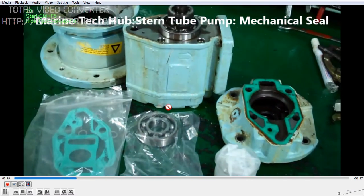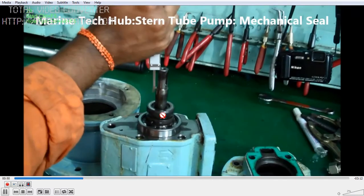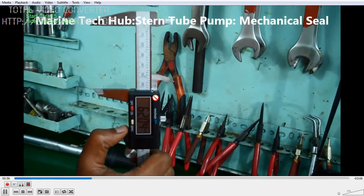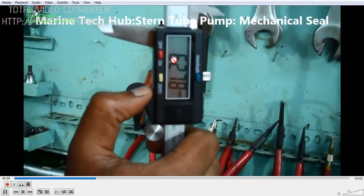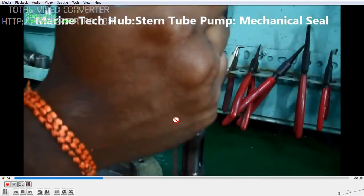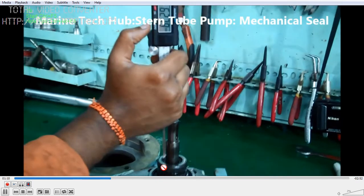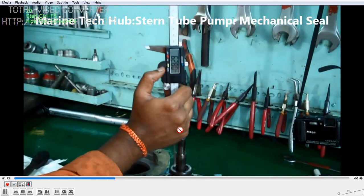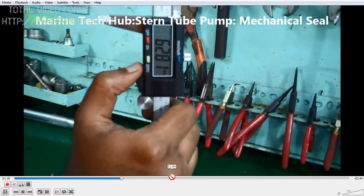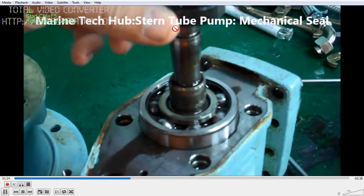This is the direction shown here. This is the new bearing — you can change it. I am removing the mechanical seal here, and I am measuring the distance. You can see this digital vernier — you can see the distance measured. This is the latest digital type vernier. We are measuring the distance from the top. When you are changing the mechanical seal, measuring this distance is very important. There is an allen screw there — you can check that, then remove the allen screw.